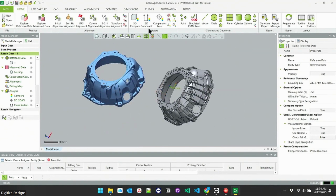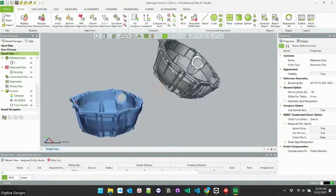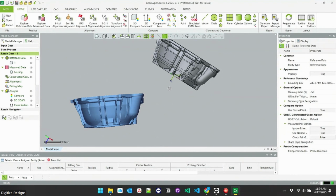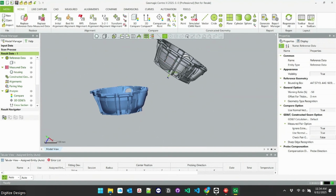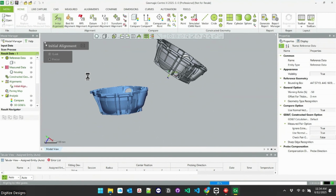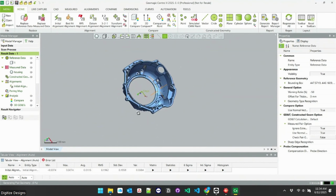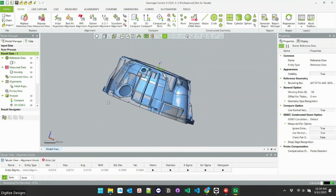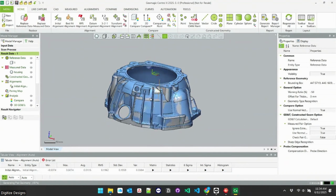They establish a coordinate system when you start scanning targets with them, but that coordinate system is based on wherever you started scanning. It's actually where that origin is. So you can see I had it oriented this way, and that z-axis is the very first position I started scanning with, and that means it's not aligned to the CAD model. That's really easy to fix. You just run through an initial alignment, and if the thing's not super symmetrical, Control X can do a really great job of making that auto alignment happen. If it is symmetrical, sometimes you have to go through a 3-point process, like you saw me do with aligning the two scans together in Studio.